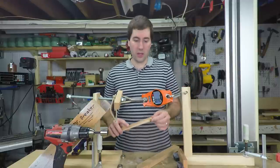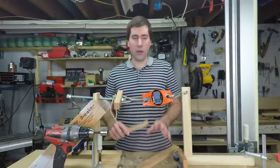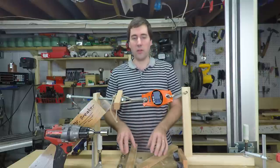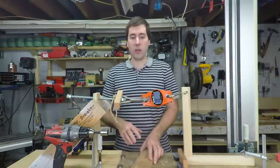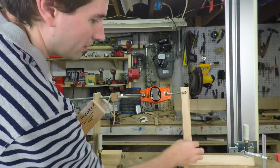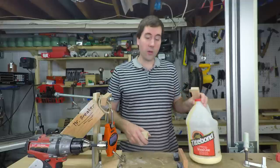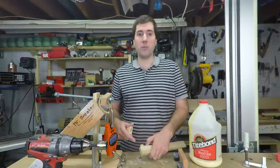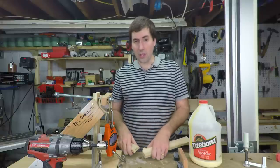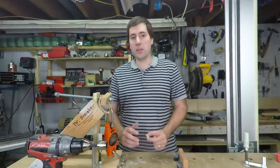I made up another sample of a domino with lots of glue on it because I didn't really like the adhesion I got between the domino and the wood. I was wondering if I didn't put enough glue or maybe my domino slot was a little oversized. I know it's terrible testing practice to retest the one you don't like, but I made one last night that I was sure had a ton of glue on it — you can see there's a lot of glue squeeze-out. It still broke at about twenty pounds. I'm using regular Titebond glue, which should work perfectly well. In general, the wood breaks before the glue does, but that didn't seem to be the case here — maybe something between the beech wood of the domino and the cherry I'm using. Either way, the domino worked out to only be about twenty pounds compared to thirty pounds for the pocket screws. I'm pretty disappointed in the performance of the dominoes — I would have expected them to do at least as well as the pocket screws, if not better. I don't know if it was the setup, the type of glue, or if it's just not conducive to that type of joint.